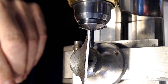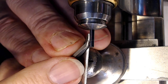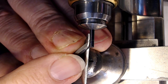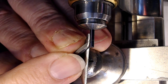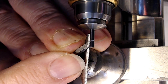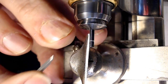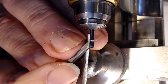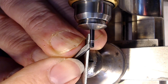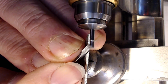So just stick the part with the Rodico on this, and then just take away some material here. I can't remember whether these things are sharp or not, but you want to take away enough material that there's an indent and you can see it easily. So there, you can see that. I've taken away a good chunk there. And now I can just flatten this down. You don't have to spin the lathe too fast for this kind of stuff.